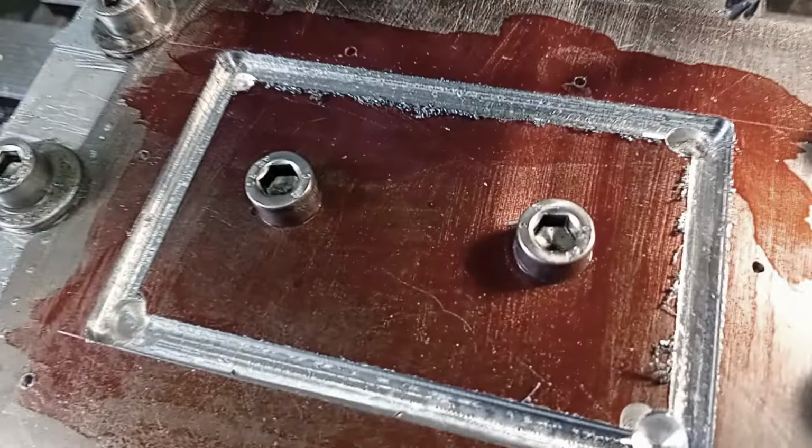So I've got a backing plate and I've got some bits of 0.5mm thick sheet to make the hinges. So the idea is I'll glue them on there and I'll machine them to the profile of the hinge using this sheet hot glue to glue these onto here to machine them. So put one on. I'm going to stack 2 rows of 4. One for the hinge on one side, one for the hinge on the other.